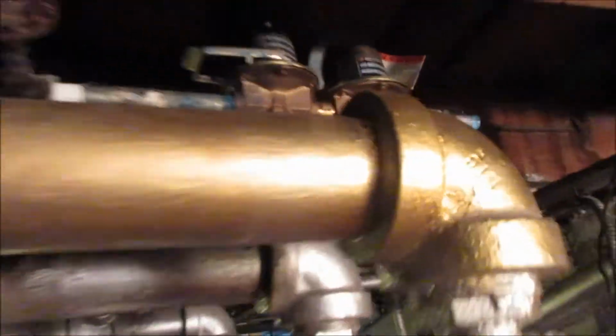What I did is there's 2 feet. I put the new pressure reducing valve on. You can see the new pressure reducing valve. But I just threw that on right now because I didn't have the right size right here. Alright. So what I'm going to do is put this in between here so now I can shut the water off. Since that's a 100-year-old valve, it's not shutting off all the water all the way.